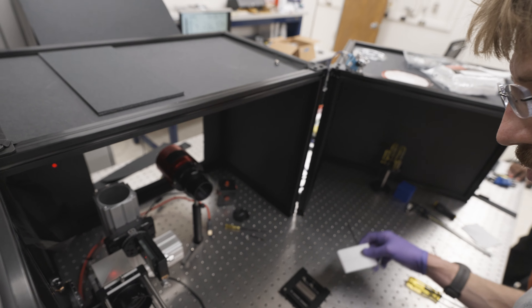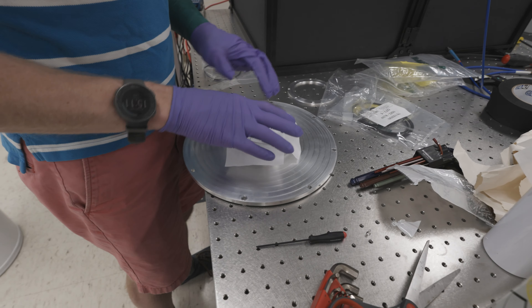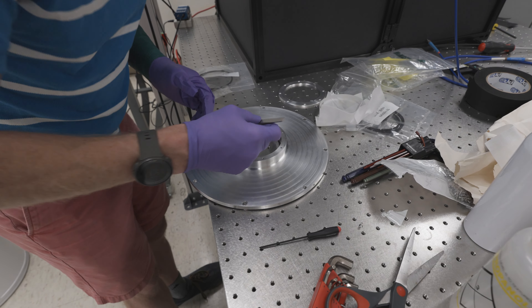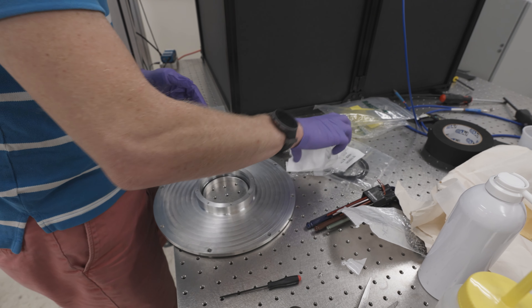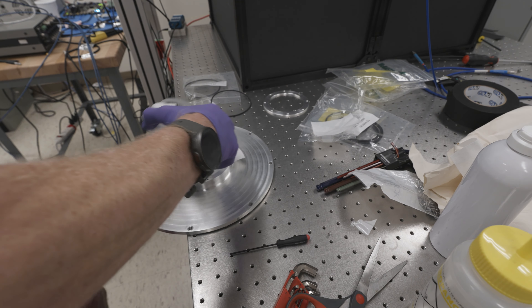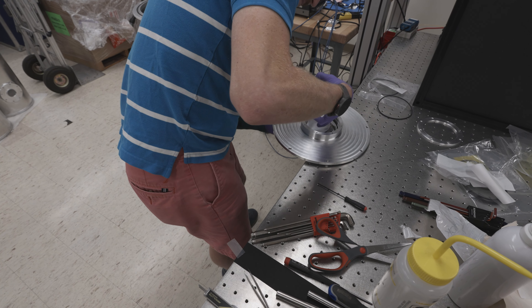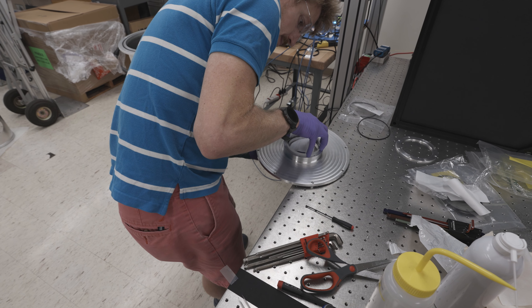There are ghosts that you see even if I block this beam. What's the problem? I couldn't even get it started. With the O-ring in? What about without the O-ring? It will barely go in without the O-ring. The diametral clearance on this kind of seal is about 5 thousandths of an inch. But that is a seal designed to conform to the Parker O-ring handbook standards. Sometimes if it's too tight, you can often downsize to a slightly smaller O-ring so that there's not as much squeeze. It probably won't work without that O-ring.